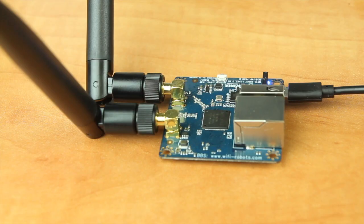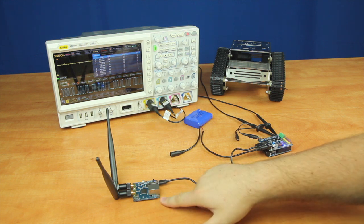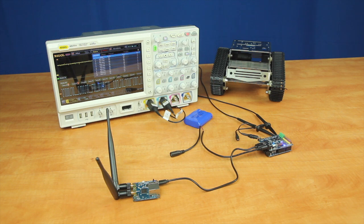The other board is our wireless communication board. What this does is first establish communication with either a computer, phone, or tablet, and then transmits out a live video feed from the camera that's built onto the robot. During the initialization process, the wireless communication board is first establishing connection and then taking the parameters, like the angle of the camera, and sending it back to the microcontroller for future use and for doing its initial setup.